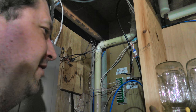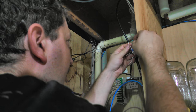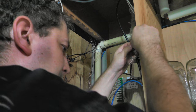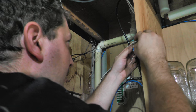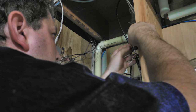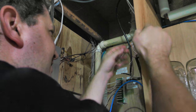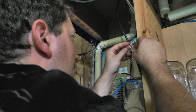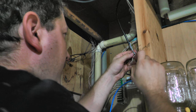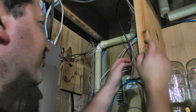Ideally, I'd like to see a little more wire on there than that. And again, we're going to go with a B-type connection. So, we'll kind of split these wires out a little bit. So, white orange, orange, green white... actually, you know what, I better be careful about this because the whites on these are not color coded. So, okay, let's make sure we do this right here, get the right white. Otherwise, we're really going to screw ourselves up here.